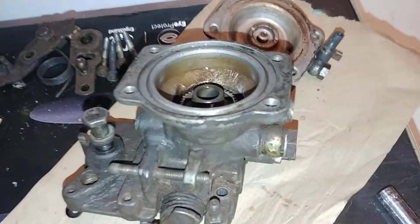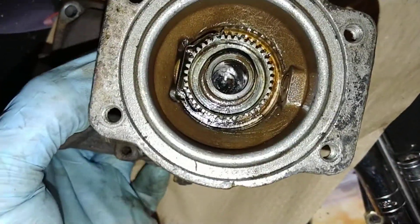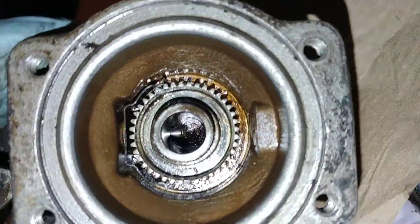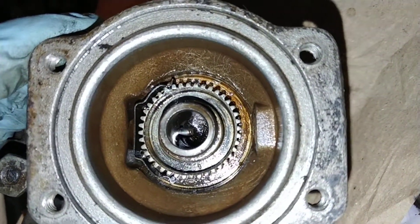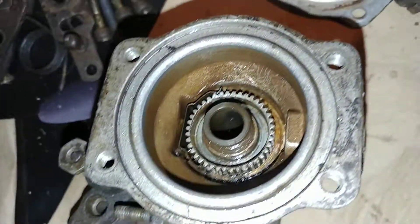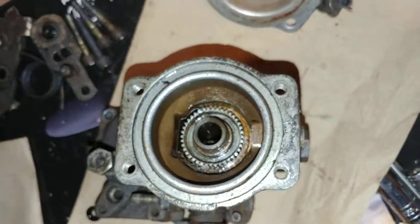When you're starting further down on that ramp, what you're doing — way down inside here, now in the off position, I'll move it — there's that little needle mechanism in there that runs along the profile of that cam. Based on how far in it is, the narrow portion would be your full-fuel portion. Based on how far in it is, you are allowed to add more fuel.